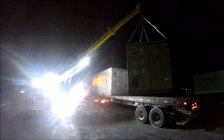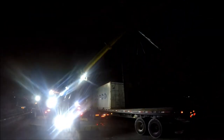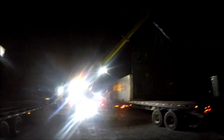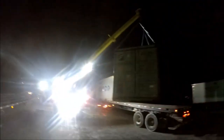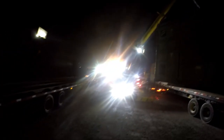Well, that's what I mean. You know, some of them are high fours and some of them are low fives. Yeah, that's only showing 5 grand. Shoot, I'm way overkill on my rigging. Oh yeah, man, big time. Each of those blue straps is rated at 21,200 pounds each. The foundry hooks are 14,000, and the clevises are 24,000.